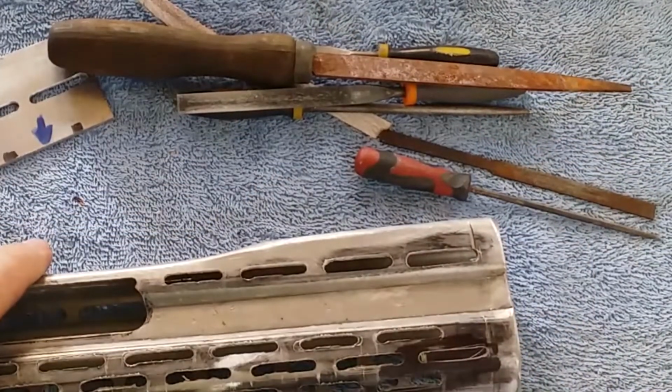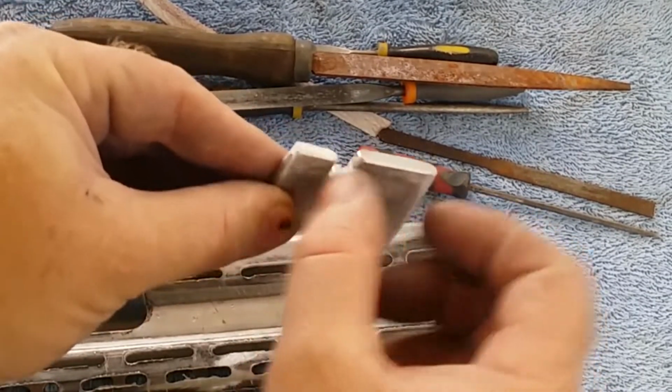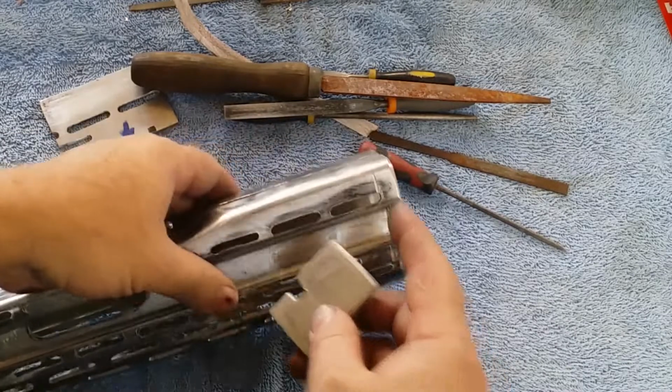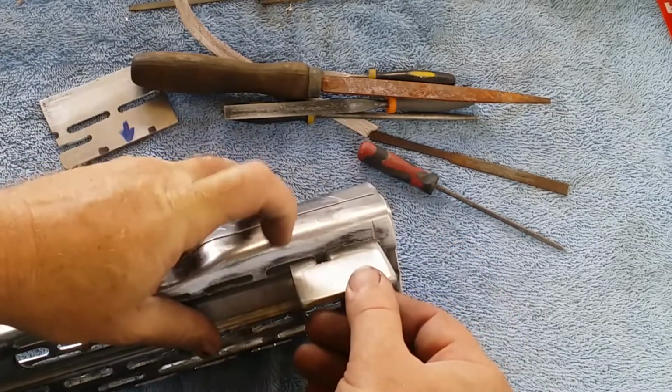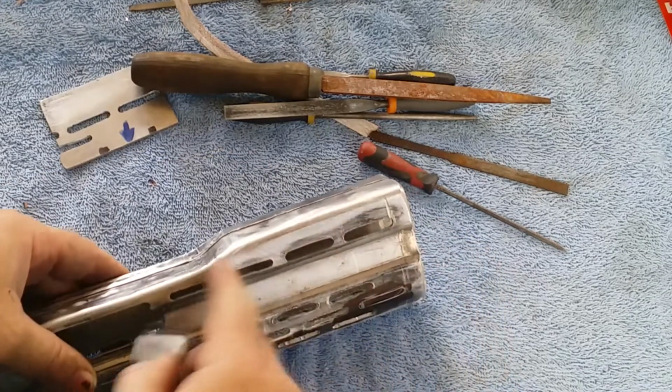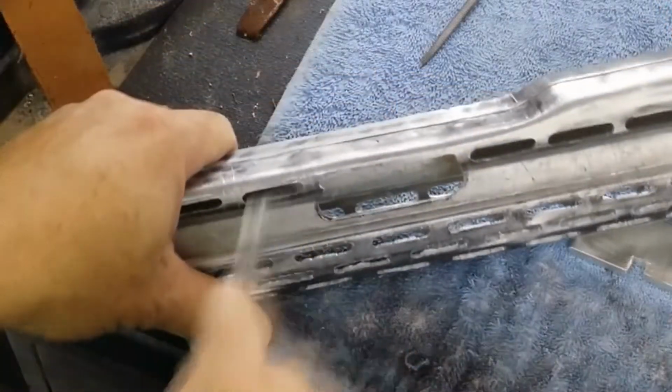To assist in doing that, I've made up another jig, and that piece has been made as an insert, so it's sort of like 1.5 of the slots. So all I have to do is file that piece out so that insert just fits, and then maintain that spacing piece between the two. And working along that way on a piece-by-piece basis, it means that I can maintain each section so that it ends up exactly the right size.